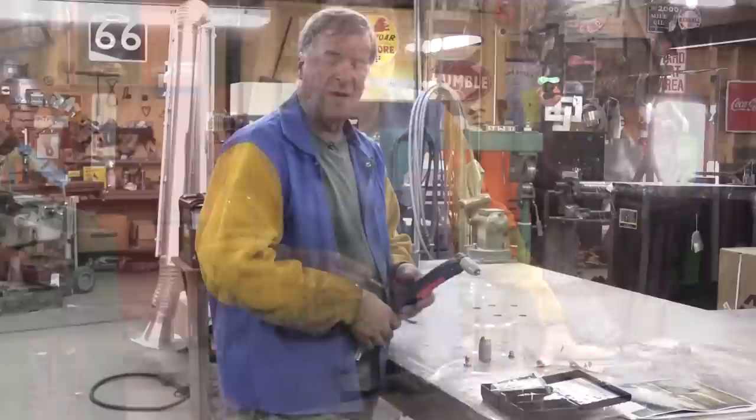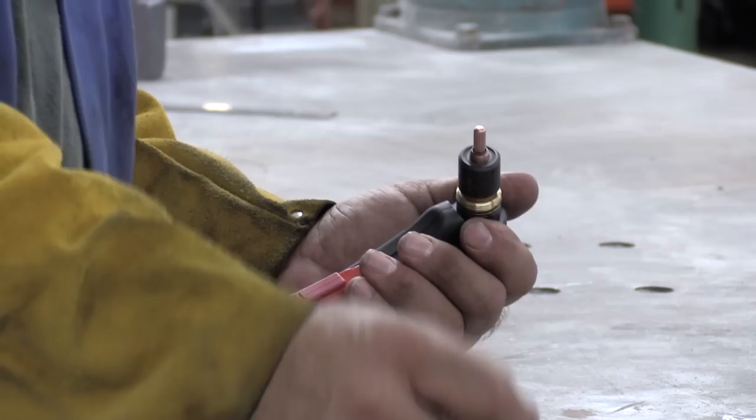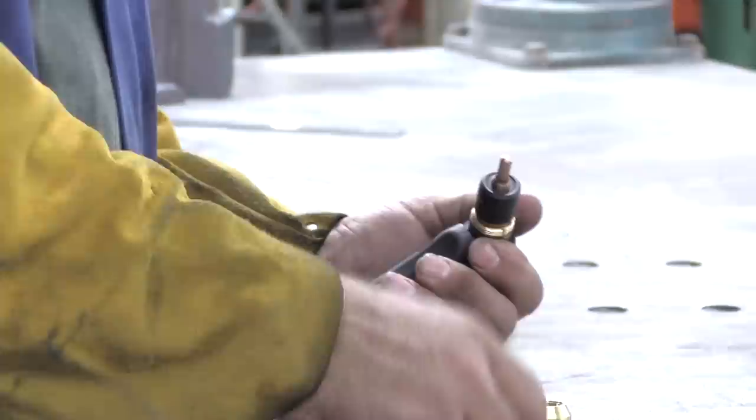But before I can do that, before I can gouge that piece of metal out, I need to change the tip — put a different tip on it, put a different cap on it. So let's just unscrew this puppy and get him out of the way. Get my cutting nozzle off and get it out of the way. That's a nice new electrode, so it'll still work for gouging — there's no difference in them. So put that part back together.